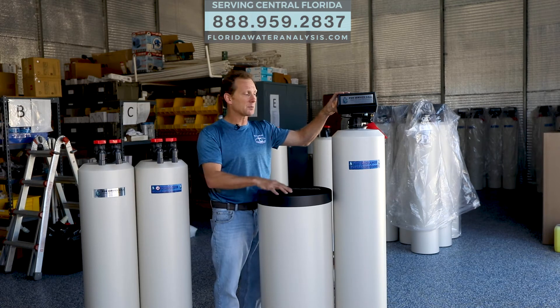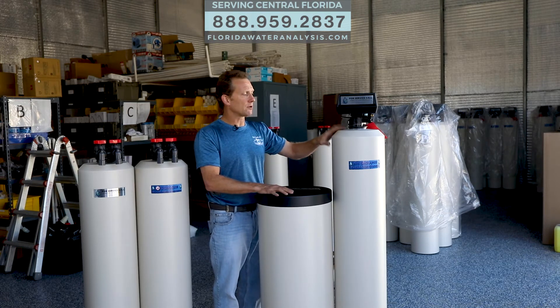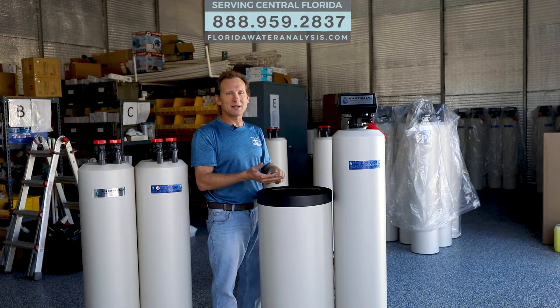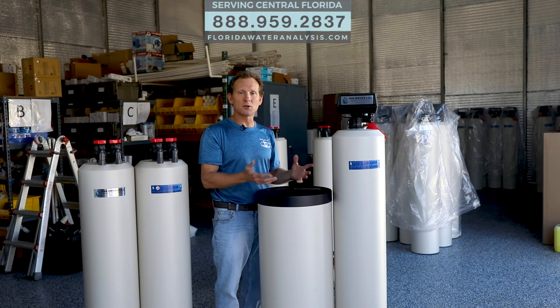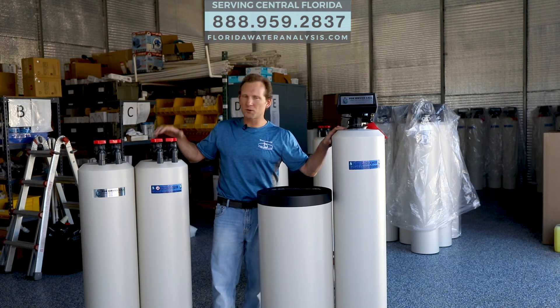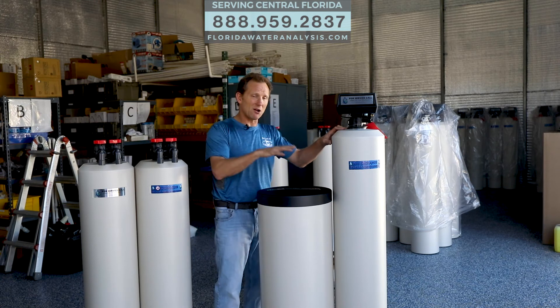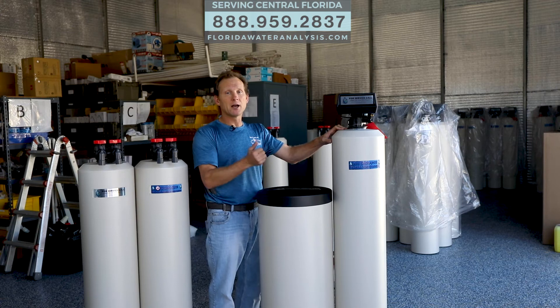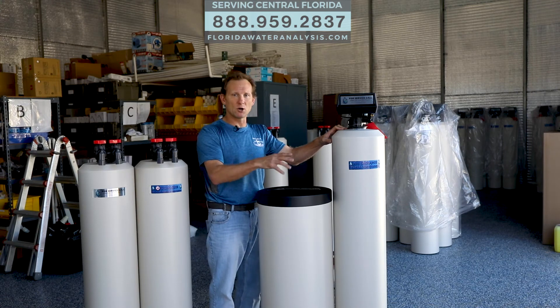I can think of some big names, but we'll spare that. So you're looking at ion exchange only, and that'll just take out your calcium, magnesium, and manganese, which is a good thing to do. But if you're on city water, you want to also remove the chlorine. So just like in the no-salt water conditioning system, this also has that very high grade, expensive catalytic carbon to remove the chloramines and taste, odor, and chlorine.